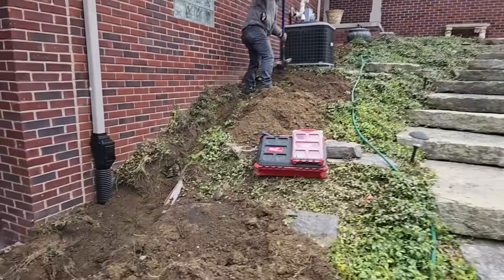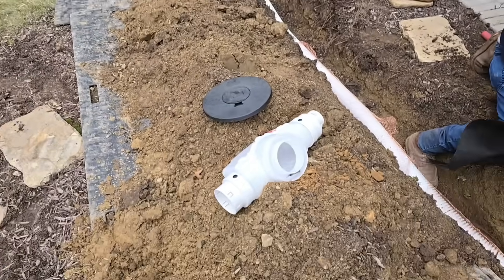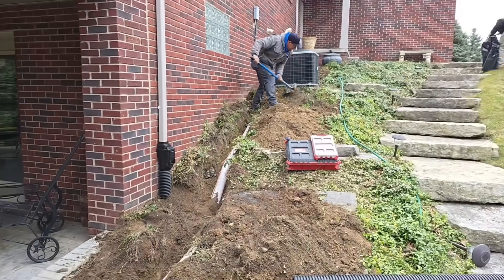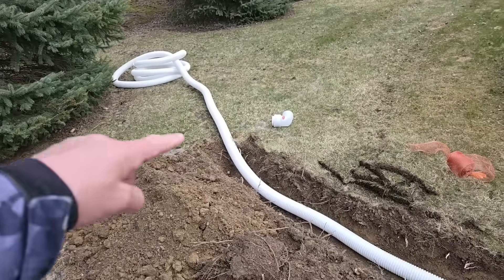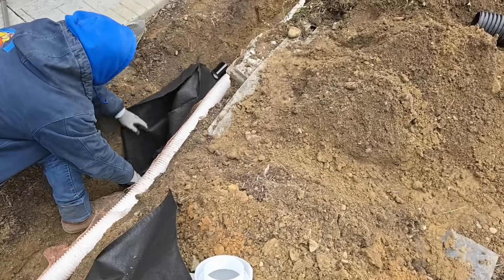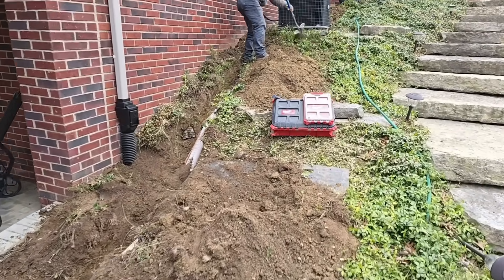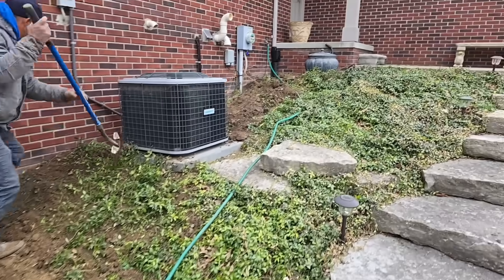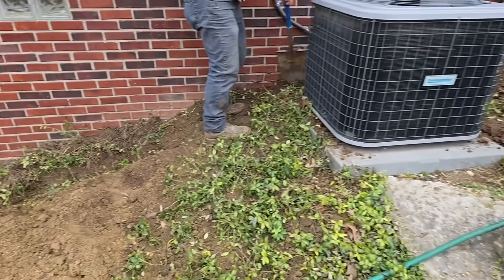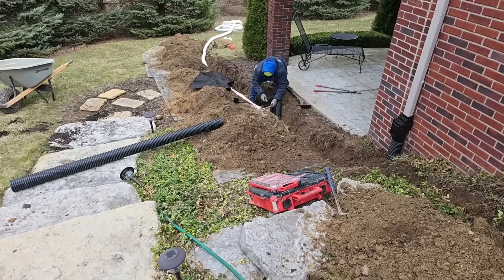The guys have one three-inch line. They tied that second downspout in right there with a Y. They're putting in one sediment trap — that's all we need for this line. They're going with the black turf plate because it'll get lost in the landscape versus the green. The guys have one piece of pipe from the pop-up all the way to the catch basin, then one piece from the catch basin to the Y, and one piece from the Y all the way up to the leaf filter. This ground cover is terrible for roots — you don't want roots getting into your system. If you keep the pipe solid for the whole distance without extra couplers and connections, there's less opportunity for roots to get into the system.